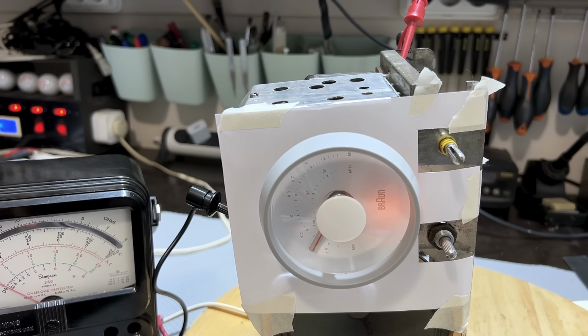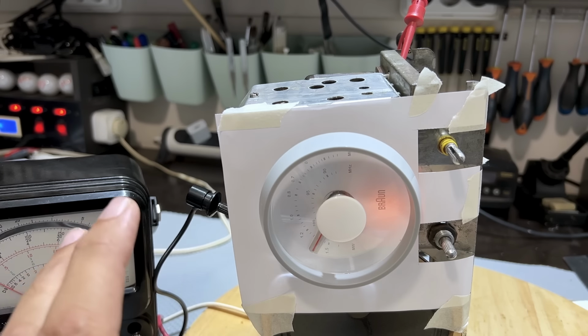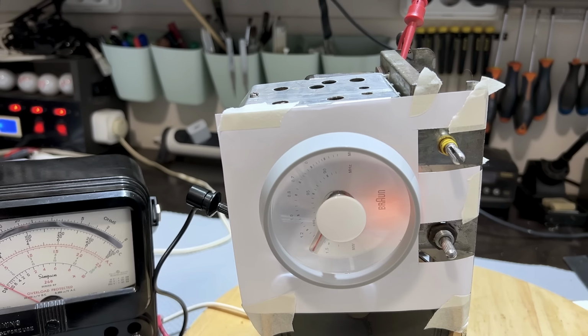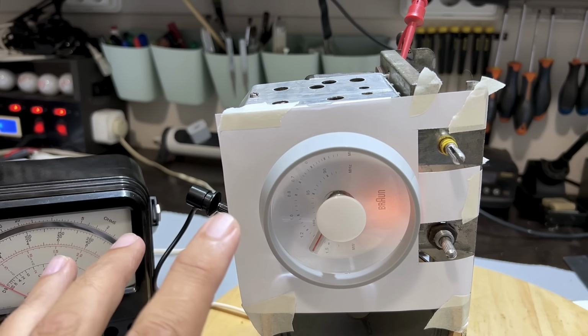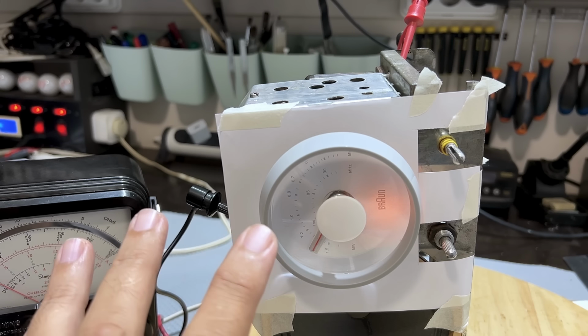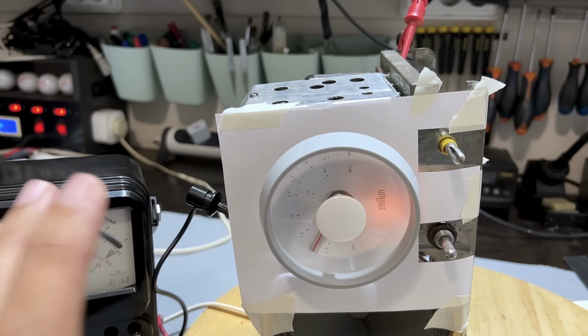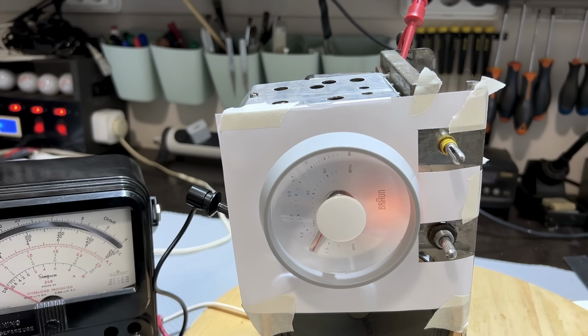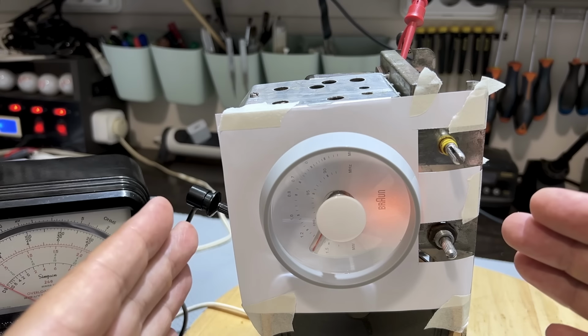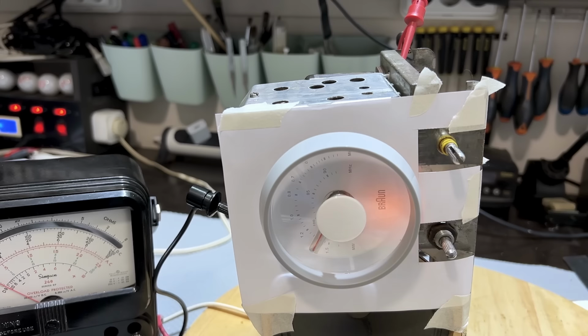This particular radio is strange because if you put this into the cabinet where the dial is fixed, you really can't get to the alignment points. So I presume they did all the aligning outside of the radio and then put it in, and they must have had some sort of jig like this, which is exactly what I've done. I've actually reproduced the dial, not just copied it, because I'm going to have to replace the original dial. I'll be printing a new version and sticking it on because the one there is a little bit faded. I placed it perfectly in terms of orientation in the front here, and I'm now able to see where the pointer is going.